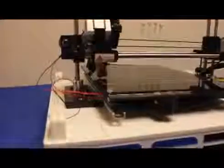That is how it should look. Now hit the turn motor off button so that you can slide the X axis across to the left side by hand. As you slide across, notice how the gap is changing. To adjust one side at a time, hold the opposite side's threaded rod firm while you twist the side that you are adjusting. Check to make sure the hot end tip is the same distance from the bed all the way across. Make any necessary fine adjustments to the Z height adjustment screw. Now your bed is level.